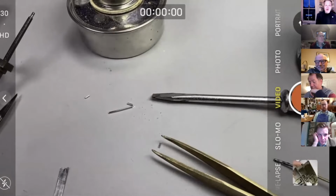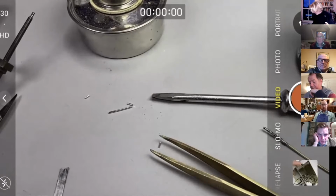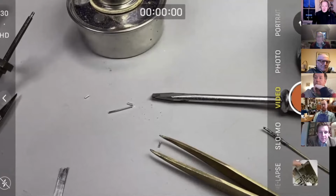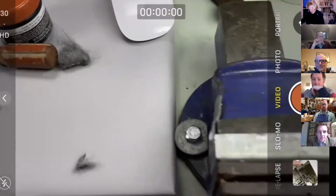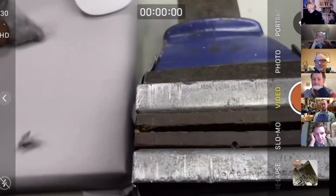Remember the golden rule, I think there are 3 rules of soldering, aren't there? Can't quite remember what they are. Oh, the first rule of soldering, according to Reed, is cleanliness. And according to everybody, if the work isn't clean, you won't solder. And I think this is often the case with brazing and all sorts of stuff. The second thing is the solder has to have somewhere to go. So if you've got bigger components and they're really tight together like that, the solder can't get into the joint. And the third thing is you've got to have the right temperature. So if you put the solder on before it's hot enough, then it'll just sit there going black. And if you get the thing too hot, then everything will go black and it'll never solder. So I'm putting off trying to do the job.